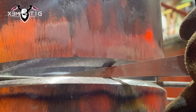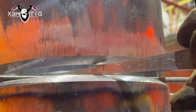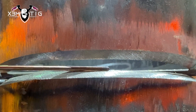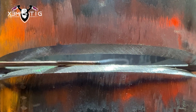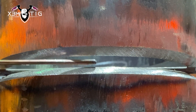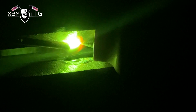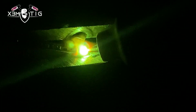As you can see the gap is six and a half mil, it's not even all the way around — there's a little bit of difference, one side is like four and a half mil. Just to give you an idea with a 1/8 TIG rod how big the gap is. I did this setup on purpose, and I'm going to put three tacks.